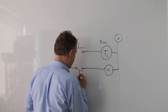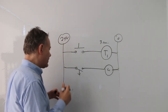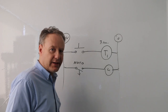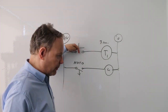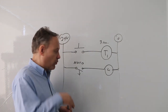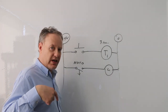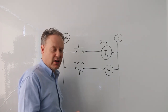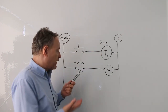Let's start with a normally open contact for an off-delay timer — the arrow goes the other direction. This is a normally open, timed open contact. As soon as I press the button, this contact immediately goes into its active state and becomes closed. Then after the set time — say three seconds — it goes back to its normal open state. So it becomes active immediately and then times out back to normal.